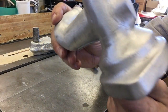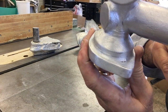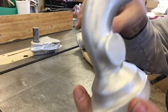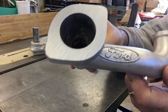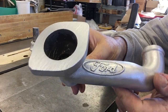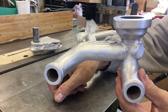All of those places where there were little sand inclusions — like underneath the flange — they looked just fine. They popped right off and the finish is nice and uniform. It colored up real nice from the wire wheel; just a real soft wire wheel with some speed on it. It's a decent looking casting.